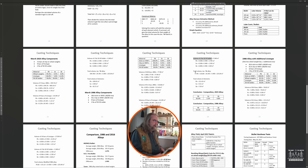Comparing the two approaches: the 2023 batch using only clip-on wheel weights gave a tin content of 2.2% and antimony of 4.8%, with the remainder being lead. The 1986 batch — where I didn't segregate stick-ons from clip-ons — gave 2% tin, which is still at my minimum threshold for good castability. However, the antimony came out quite a bit lower at 3.4%, which does affect hardness somewhat.